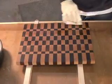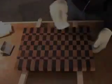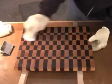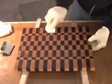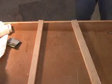On day two, I give the board a second coat of the oil-wax mixture and once again let it sit overnight. Finally, on day three you should have a nice waxy board. I like to remove most of the excess wax with a paper towel and do my final buffing with a clean cotton rag. When it's all said and done, you should have a nicely protected board.